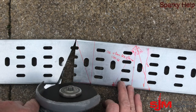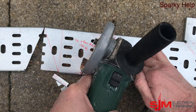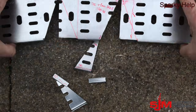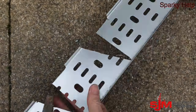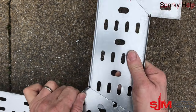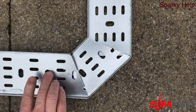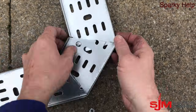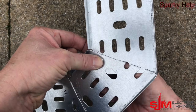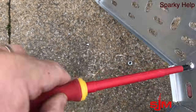Those cut out. Cut those end bits out. Make sure you've filed up the ends — before putting it all together, make sure everything is filed and nice and clean. Sod's law says the holes won't line up, so we need to line up and drill holes for fixing. Make sure it is 90 degrees, and we'll drill through those points. Then put in our gutter bolts or roofing bolts, make sure they're tight, and make sure it is 90 degrees.